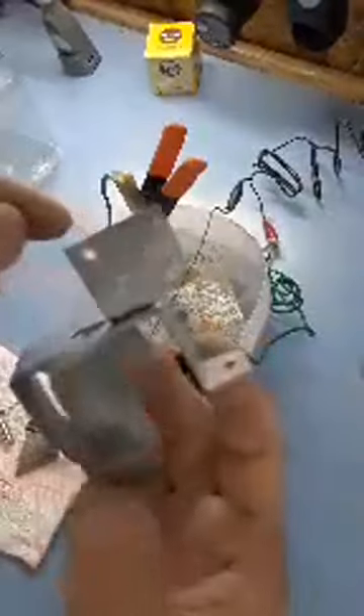This is where I hit it with the sandblaster. I really need to chromate these afterwards with a blue zinc chromate because it took the zinc right off. So I'm going to have to redo this one.